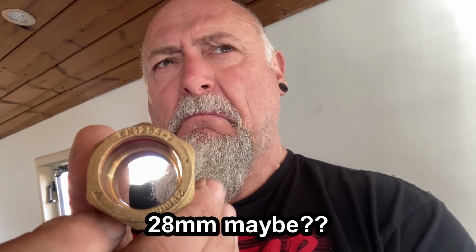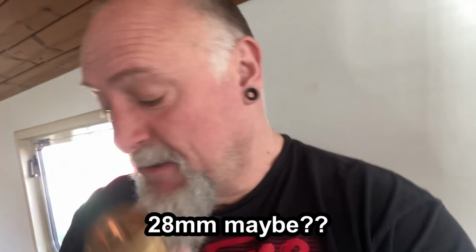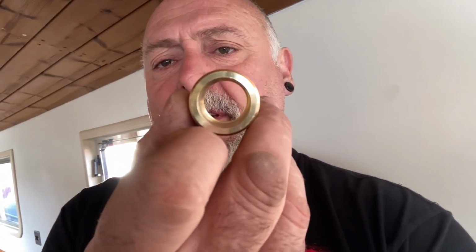But so these are the fittings that will go into there. So these are 1-inch BSP tapered. That's important. Okay, so they're obviously too big, because these are for, what's the next size from 22mm? I don't know. 30mm? I don't know. I ain't using that. 22mm. These are too big. So I've not seen these before. These are like a reducing olive. So reduce it down to 22mm.